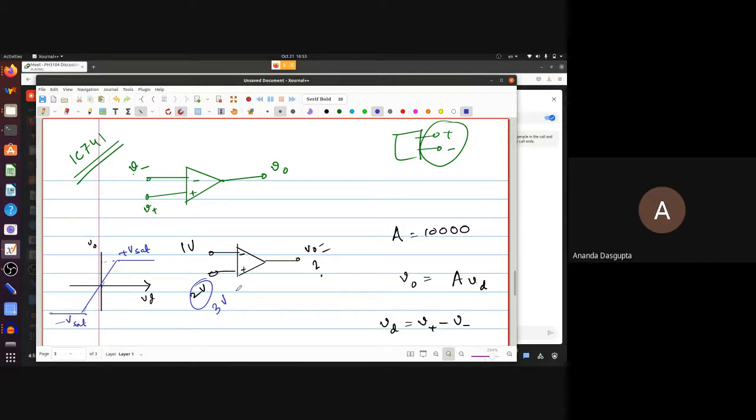This is the simplest possible op amp circuit, just the op amp connected to voltages, nothing else. Sir, this gives stability. If we change the input voltage, then also we are getting the same output voltage. So this gives stability. Okay, that sounds reasonable. Anybody with a difference of opinion? He's saying that this circuit has a utility, that the output stays fixed. Does anybody have a difference of opinion with that?